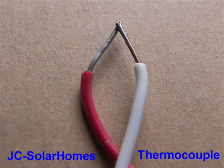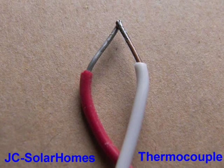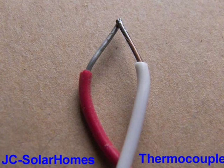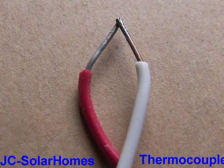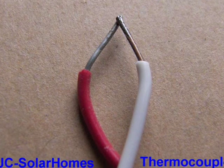The three most common temperature probes are made from thermocouples, thermistors, and calibrated sensors. Thermocouples consist of dissimilar metal alloys that respond to heat by generating a voltage at the junction where the wires are soldered together.